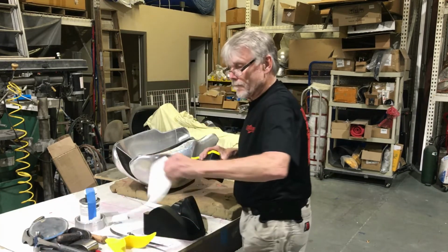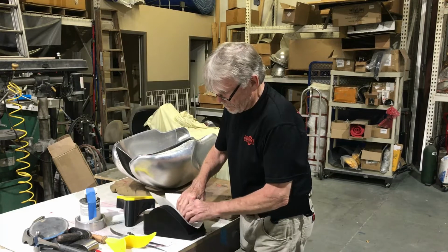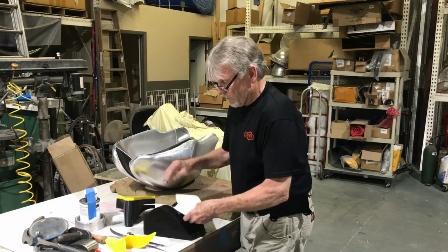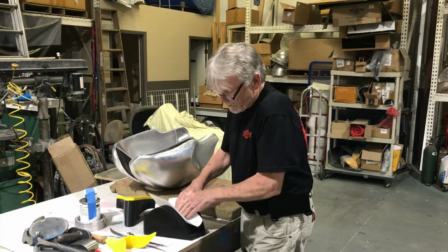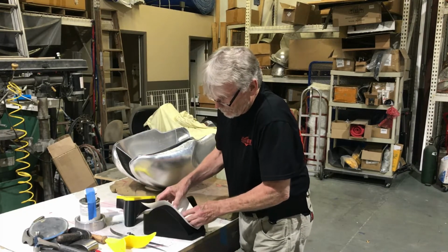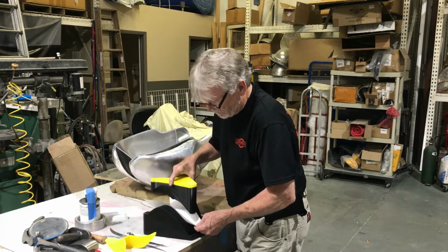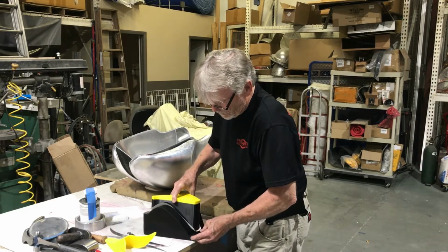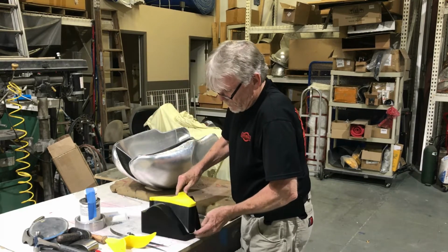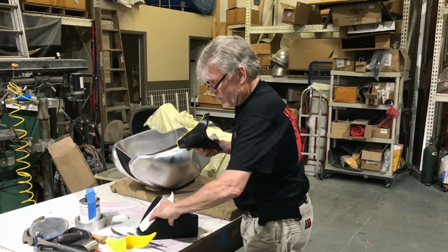So this is the approximate shape of the metal part that goes in here. What I'll do first is I'll hammer this into here, and I'll get it centered. I give it kind of a head start, and this has to bend two different ways. Let's try it like this. This has to bend along the front in this direction, like so. And these have to make compound curves, compound bends as this comes down. So there's a tough little spot in here where that metal has to really get worked. And when this comes down in here, we've got a little leftover material here on purpose. And this presses the part together, like so. And that's our basic shape.